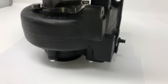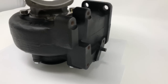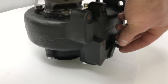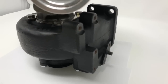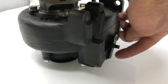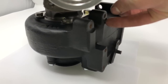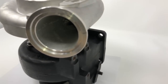Here's a look at the turbine housing. The way to tell the differences is mainly how the wastegate connects. The wastegate is going to connect on these three and push up, but on a couple other models, one model has the wastegate lever that will move from here to here, and the wastegate will mount here into this one, and then the wastegate will sit right here and push that way.